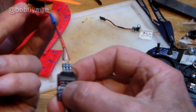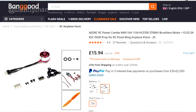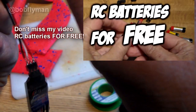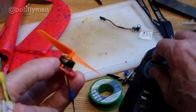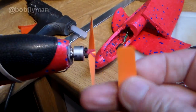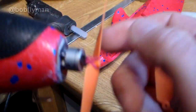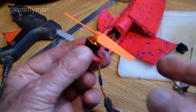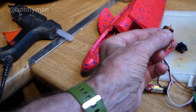Decision is made. I've just put this one back together - had to solder tiny little pins back onto this motor, which came complete with a tiny little 5-amp speed controller that will only work with a 1S lipo. I've got a vape battery from a throwaway vape I found in the road. I think that's a 3x2 prop on that, and the receiver that's only got two channels. It pushes a hell of a lot of air. I was only testing it with that prop because it slid on nicely, but you can also use prop saver things for these 3x2 props. Incidentally - don't try this at home. It's not a good plan to test motors with a prop on while holding it in your fingers. He said, and the prop came off.